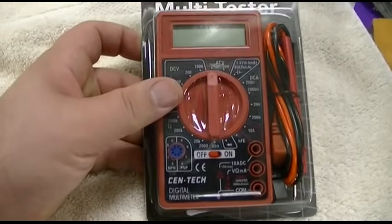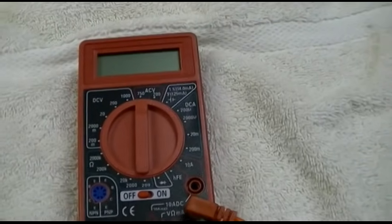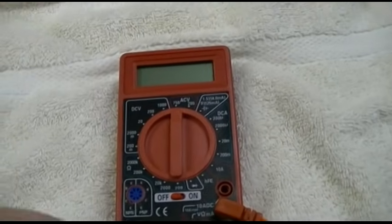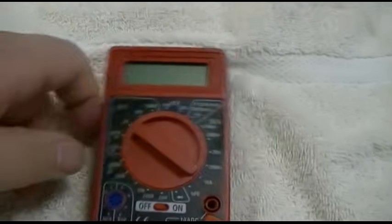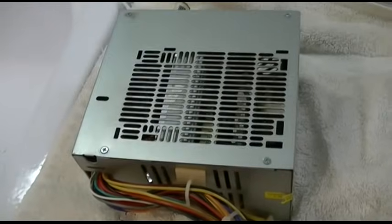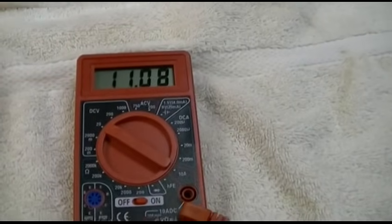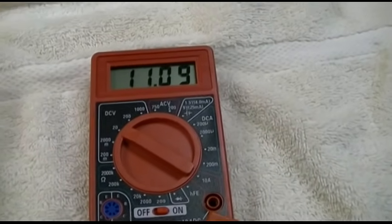But there are some adjustments that you can make with it, so let's get this opened up and I'll show you how it all works. You should have basic understanding and working skills of the multimeter — I'm not really going to go into how to use it. Just to give you an example, we can set this to the 20-volt scale DC, and you have your two probes here. I'll test the power supply I've been using and see what that reads. I have this hooked up now to the supply on the 12-volt rail.